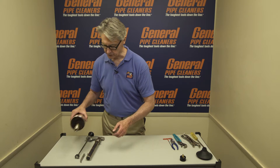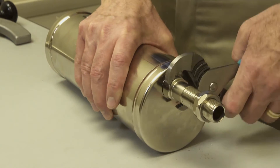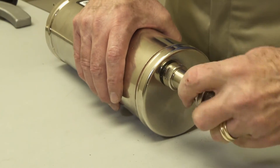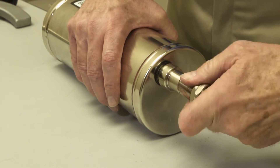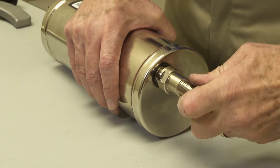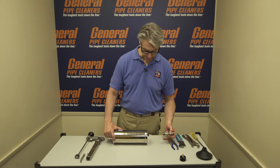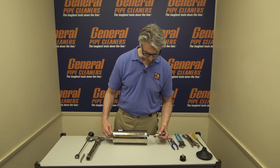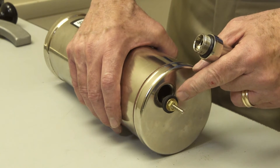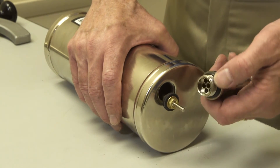Let's take off the shank at the bottom of the air cylinder. Keep an eye on it and keep pressure on it because it's sort of spring-loaded — it'll have a tendency to get away from you. When you're taking that off, make sure you're holding it because it can pop. You don't want to lose any parts. Now you have an O-ring here — that's very important — and you have a gasket right there. Both are very important for the functioning of the trigger to make sure it's efficient. Change these while you're in here.